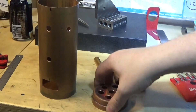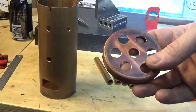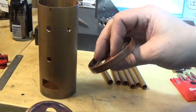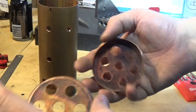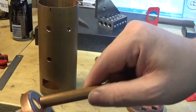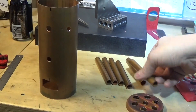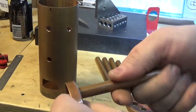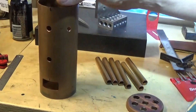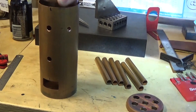Now, I've drilled these two plates. There's a fair bit of work in this because it's copper and it gets hot, and there's dangerous swarf and stuff, and it's stringy and it's really not much fun. But I've cleaned them all up and reamed them all so that the tube's just a nice fit in there. If they're too tight you'll never get all these bits in for the silver solder, so I've got these so that they're a nice tap fit — they should be good.